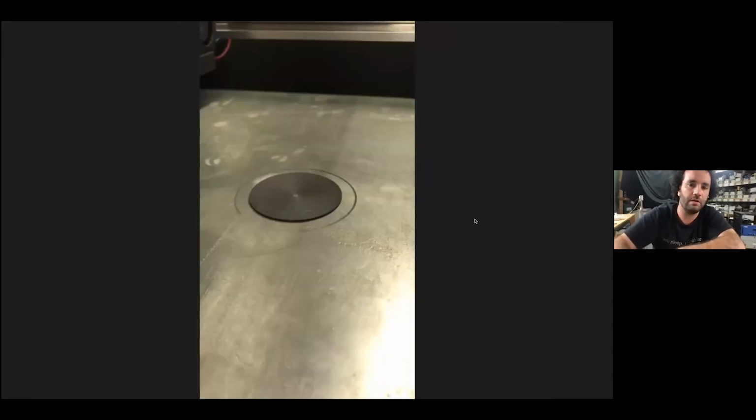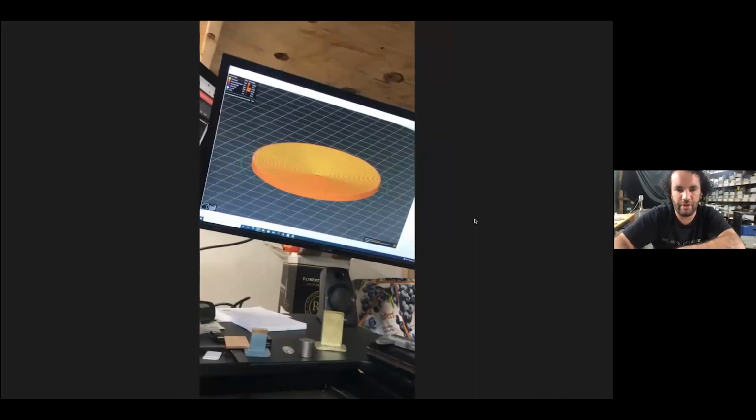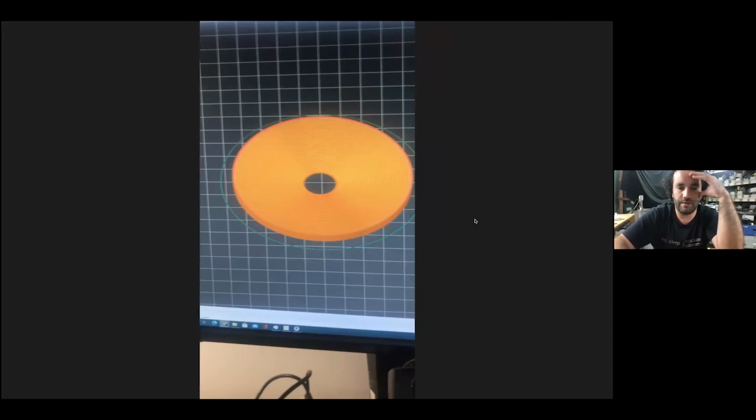These are different discs that I made, and then we went with a thicker one because the correction wasn't strong enough. Then it was too strong in the center, so I cut out a center hole. Basically what we ended up realizing is that the iron embedded inside this iron PLA plastic wasn't strong enough, so I had to go with just pure iron and CNC it out.